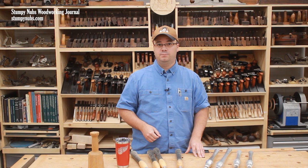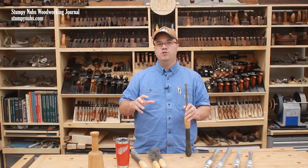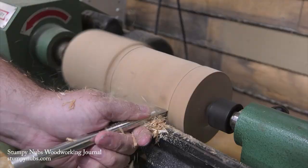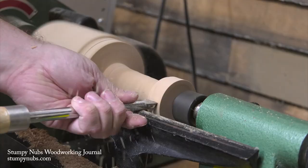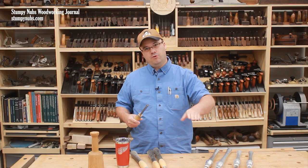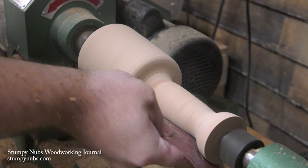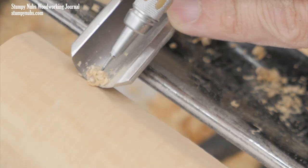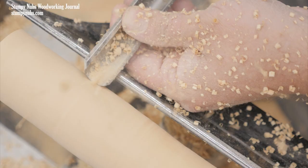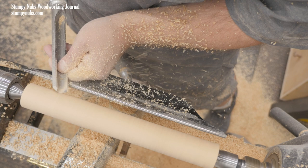The reason why carbide tools are so easy to use is because most of them are essentially scrapers. There are some with special cutters with hooked edges that do more of a shearing effect, but the vast majority are simply hard cutters that scrape away the wood fibers. Scraping can tear the fibers, especially on the end grain. And when you cut coves and beads or really any shape on the lathe, you're exposing a lot of end grain in the sides of all those hills and valleys. Carbide tools leave a surface that requires a fair amount of sanding to smooth out when you're done. Traditional tools plane the surface — they shear or slice the wood fibers. Instead of dust and chips, you're going to get more shavings, and the surface left behind is often smoother to the touch and more attractive to the eye.